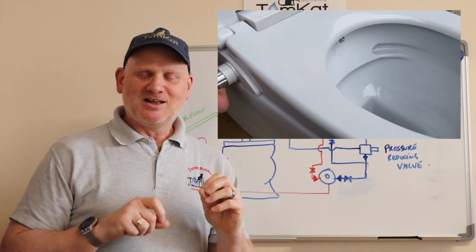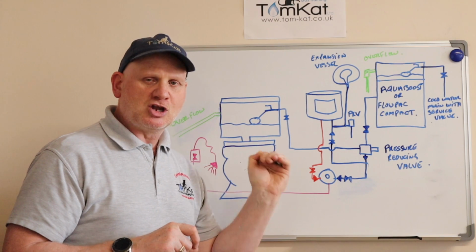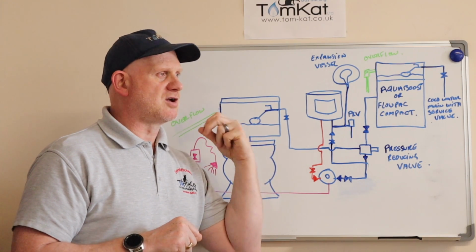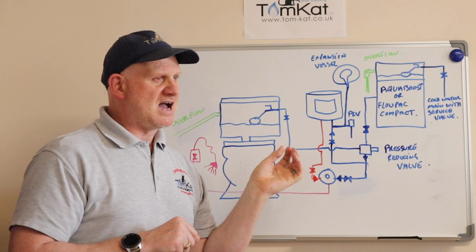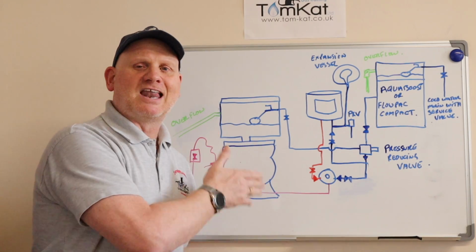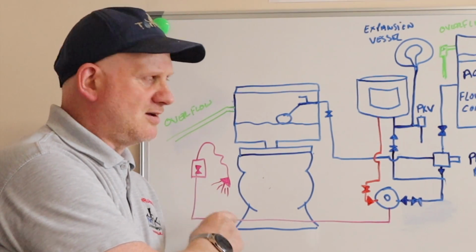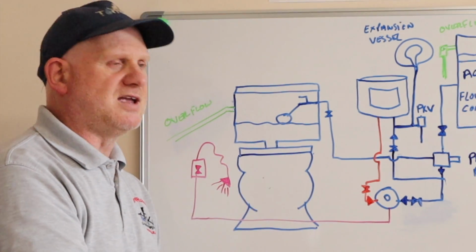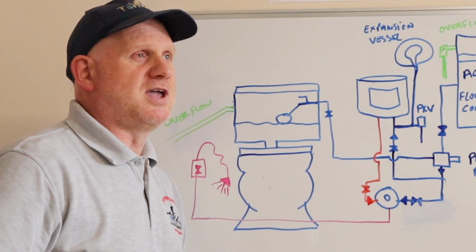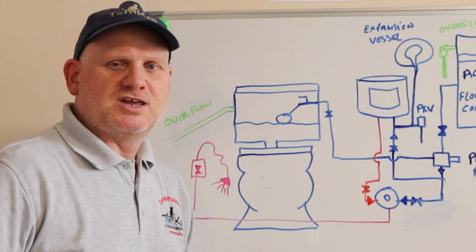Anyway, so yes, there are toilets out there that you can buy which have a spray unit which comes out of the toilet seat and basically complies with the water regs because it has an AD air gap built into it, and there is no way that pipe can go into the submerged water because of the spillover level of the toilet pan itself as well. These don't comply unless you do all this. Whereas the pre-made toilets have to comply technically to be able to be sold in the UK, because if that toilet was sold here and somebody was poisoned, the manufacturers would be prosecuted for that.